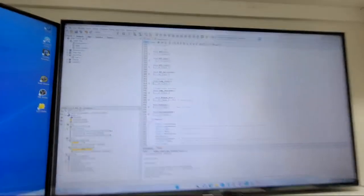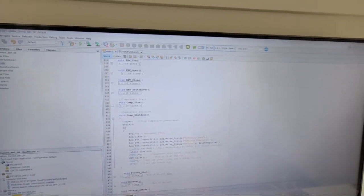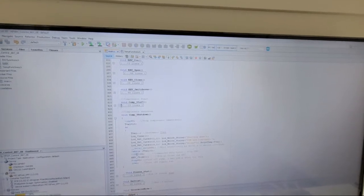I have, like I said, defrost subroutine. There's a bunch of graphics in there. What it does, it's a counter timer down. I have a timer counting down in both of these. It's a simple one for the freeze stat. All these are subroutines. It just goes through compressor shutdown. That one's a real simple one. Compressor off. It's going to duty cycle for the fan goes off, pump goes off, supply fan goes off. It just makes sure all that stuff is off. Compressor start.